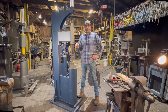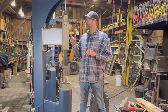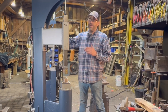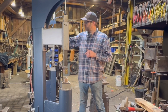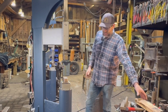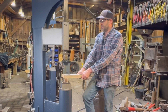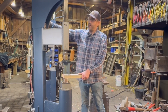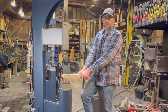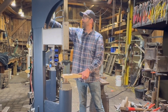The really cool thing I'm so psyched about with this hammer is it has a single blow mode, which makes it almost like some old-fashioned steam hammers. I'm switching over to that mode now — just a quick easy flip of a switch and a valve. It parks in the upright position, ready to do a single blow. I'll hit it once — you can see it comes down and does that blow. What's nice is I can control the intensity of that blow; see how much softer that one was.